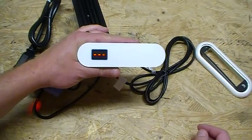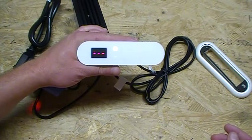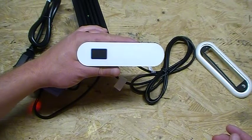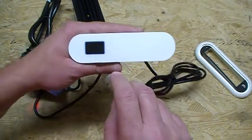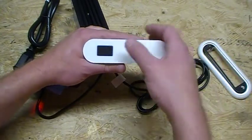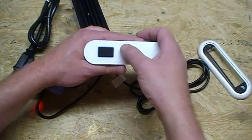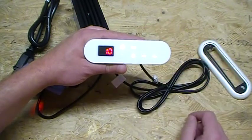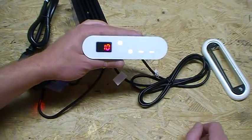First it's going to have three dashes there in the middle as it begins to boot up. It's going to take a couple of minutes for the system to come on. CO1 is going to light up, and then eventually we're going to see our temperature display. We're going to have to set our clock first. There's our clock signal flashing there — the far left indicator clock is now flashing. When I hit that, I'm going to be able to set the timer for the pump in five-minute increments. If I hold that down, the pump's going to run for 10 minutes — you can see that number 10. And now it's reading 73 degrees, which is 73 degrees in the workroom.